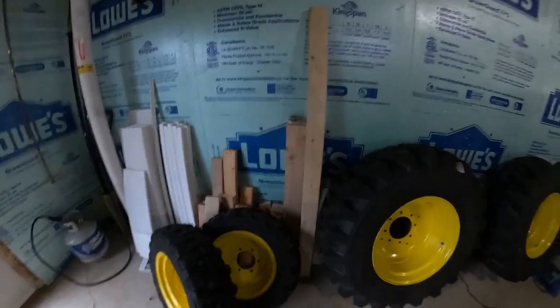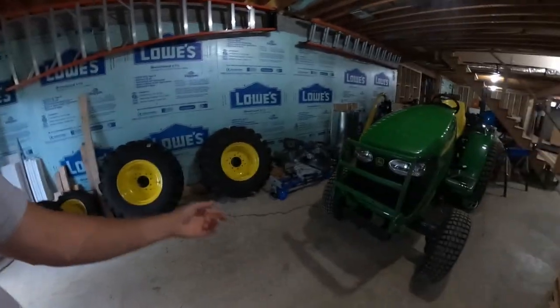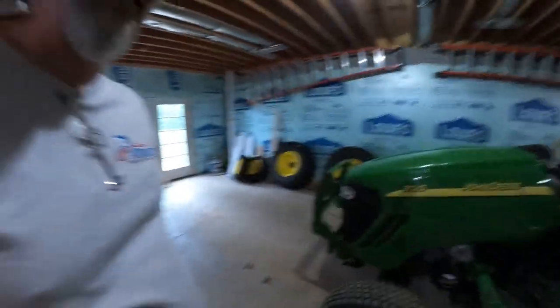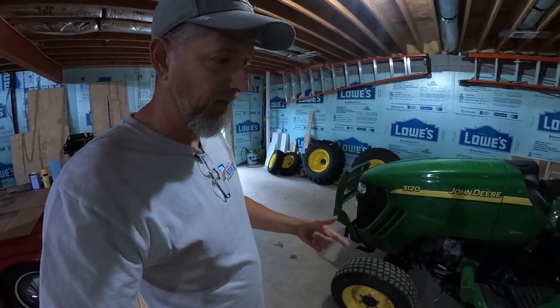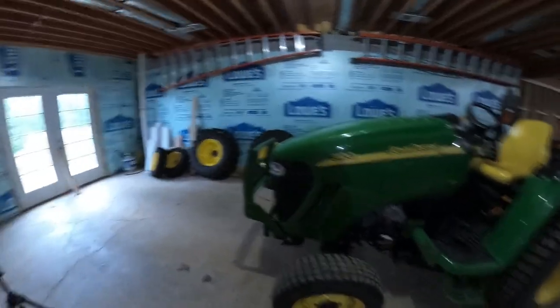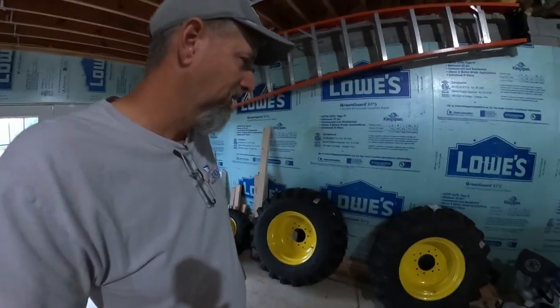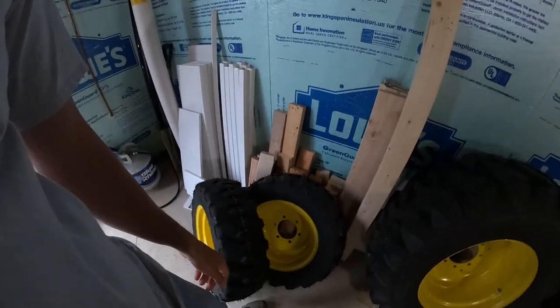My other tires are good for the grass, and hopefully these aren't bad for the grass. There are four, so they should be fine. But these ones are such soft walls. When I'm really picking up loads with the bucket and using it as a tractor, they can't handle the weight. And also out on the farm, there are some big hawthorn trees with big thorns, and I've already punctured one once and had a flat tire and had to fix that from the inside. So I think these are gonna be way more effective for what I'm doing, because I'm half tractoring and half mowing, right? These R4s are supposed to be not so bad on the yard. I guess we'll find that out though, huh?